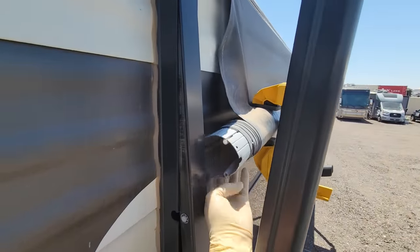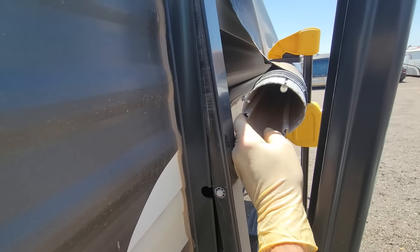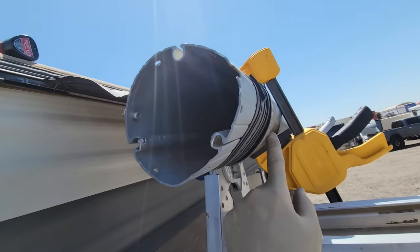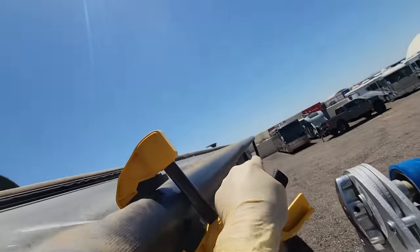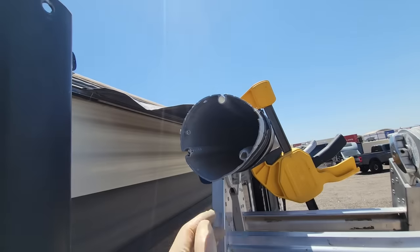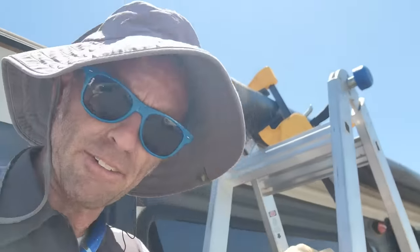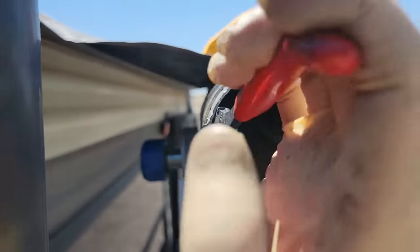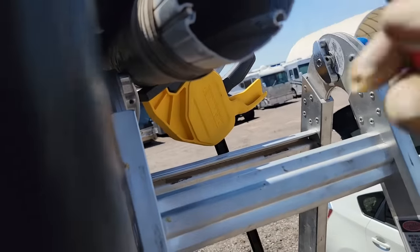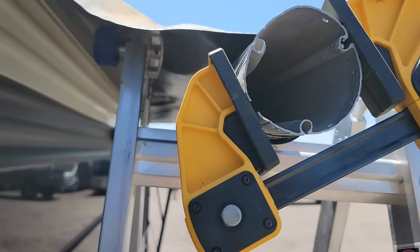We have a little bit of an added difficulty in that the tube got smashed a little bit, so it's going to be hard to put that cast cap back on with a deformed tube. So I do have to straighten this out a little bit. There's a big divot and dent in the tube right there where they hit something. This theoretically should be getting a new tube — you can even see another dent right over there. But the owner just asked me to do a budget repair, so I'm just going to have to straighten this out a little bit so the torsion actually fits on there. I still have one rivet in there I need to get out. Now because I have my clamp here I might as well just try to use it to squeeze it and straighten it all out.